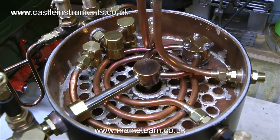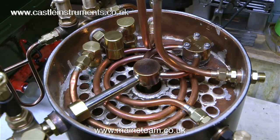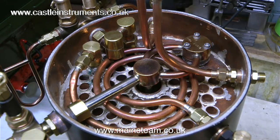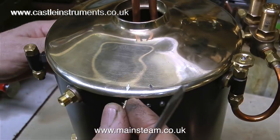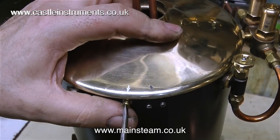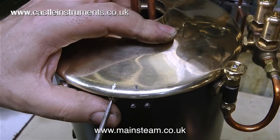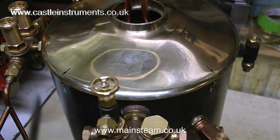So what's all this other piping? This coil of piping is a boiler feed preheater. The clack valve is at the right-hand side, so cold water comes in and goes around this pipe a couple of times before it enters the boiler. Because this pipe is in direct line with the fire coming up the fire tubes, the tube gets hot. So the cold water fed in from a pump starts to be heated before it even gets into the boiler. This device is known as an economiser because it saves energy — by preheating the feed water, the boiler pressure doesn't drop quite as much as it would if you were putting very cold water in.